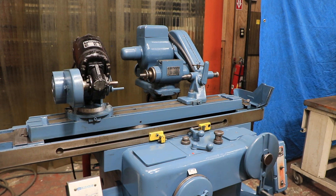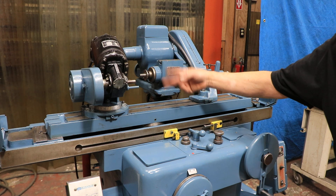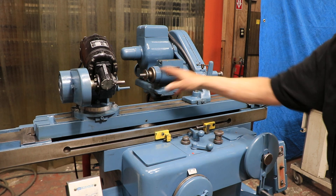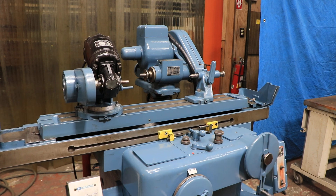You spread these dogs out and you can increase the grinding length. In the tooling there's even a three point steady rest and a two point steady rest, if you were going to do some long parts, some reamers or whatever on here. The table is adjustable — you have these adjustments on the side here.